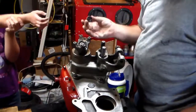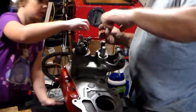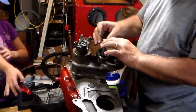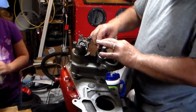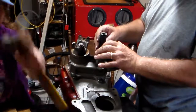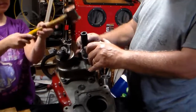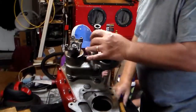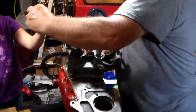All right, we're going to put the open side of the seal down. Let's get a little grease for the shaft right here. Put it on the shaft. Good. All right, we're going to set this seal down in there. Slide it down. You've got to be careful not to tear it on this cut-out part. We set it down there like that. Got the hammer? Metal. Okay, tap it down. Hit it like a piñata. Okay. All right, there's that one in. Got to do the other one. Got it greased? Yeah. Okay, the opening goes down.